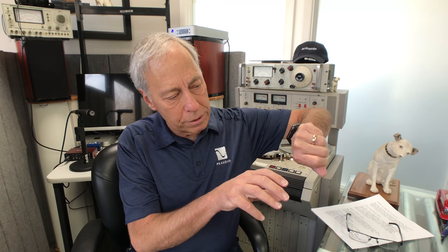That said, a lot of companies like to put bigger ones — the 20 amp — which will give you 2,400 watts. The formula is simple: amps times volts equals watts. So 20 amps times 120 volts equals 2,400 watts. There's no real need for that. The difference in the connector is basically that one of the pins is flipped over so you don't mix the two up, and it really doesn't make a whole lot of difference unless you truly need that much more power.